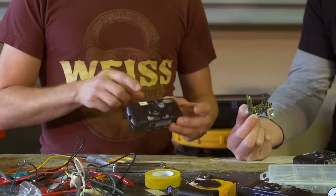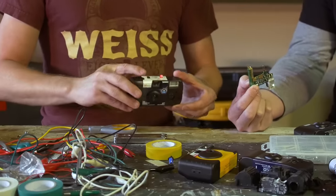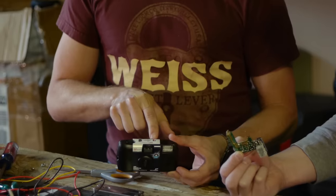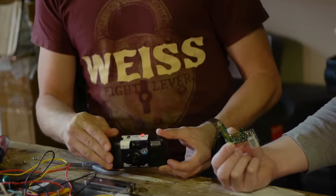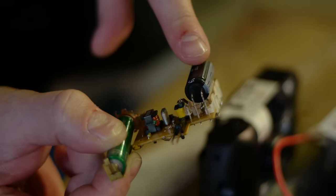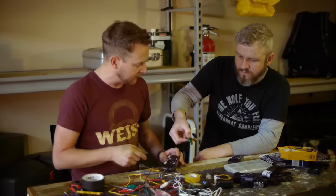When you use one of these disposable cameras with a flash, you turn on the button for the flash and you wait until you see this red light charge up. And then when you actually pull the trigger, boom, it's discharged, and then you notice that as long as it's set, it will recharge again. Behind the scenes, what's happening is it's drawing electricity from this battery, it's charging up this giant capacitor, and once it's turned off, that capacitor is still fully charged.